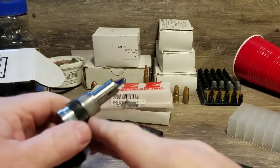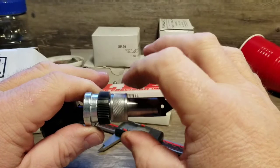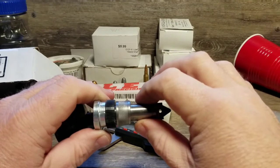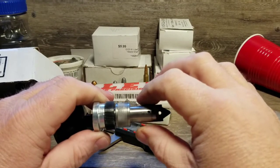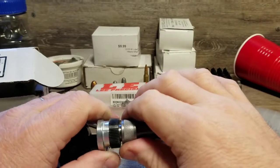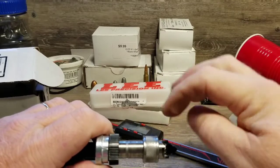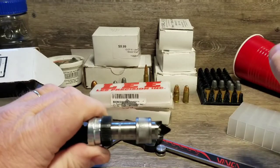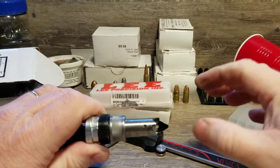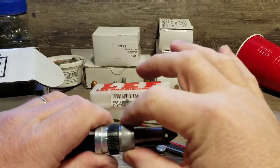There is also a spacer ring. There's a case length in there — I think it's one and a half. If you're doing a shorter case, like a nine millimeter, you remove this ring — it just pulls off. There's a little clip in there and a groove that retains it. For rifle calibers with long cases, you keep that locked on, and it slides up and down here.